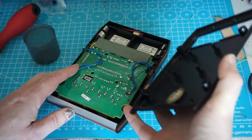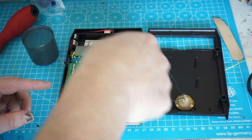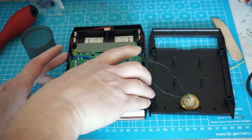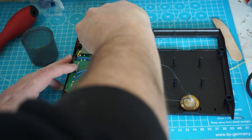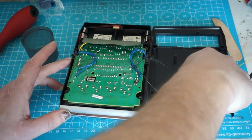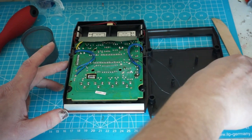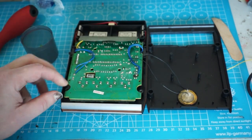I was actually surprised when I opened it to see that we have two tiers. We have the main PCB and underneath that there is another printed circuit board with the location for the pieces that you press into. As I lifted up this board, there was this sticky back covering that I needed to undo. I realized that the connector on the left side wasn't inserted or was only partially inserted. In order to find this, I need to take off this piezo and these blue wires, so I will desolder them in a moment so we can have a better look.